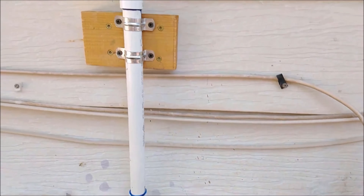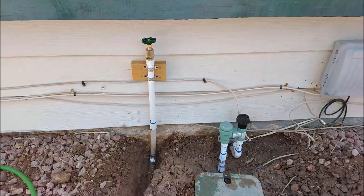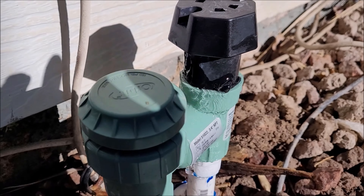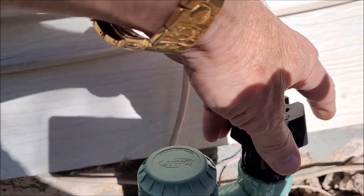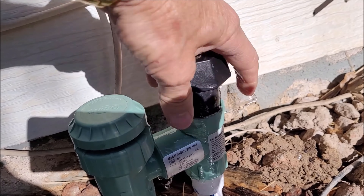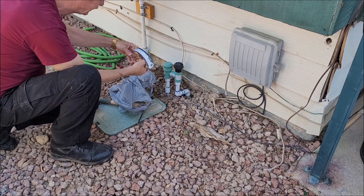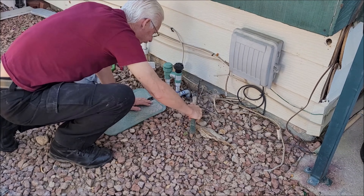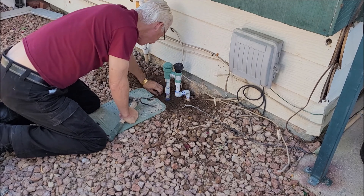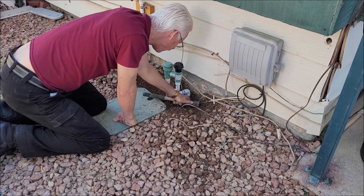There was a big problem though. This is not the right kind of anti-siphon valve to buy, because only after a couple of months this is what happened — look at that mess. We get water running worse than ever coming out of that valve. So I had to go buy another one. This one was only like ten or twenty dollars, and the metal kind is like sixty dollars. Apparently it's worthwhile getting the metal one.